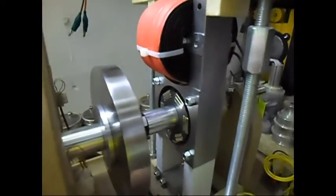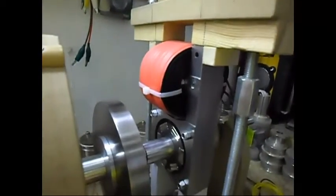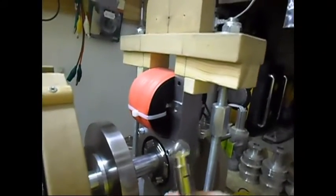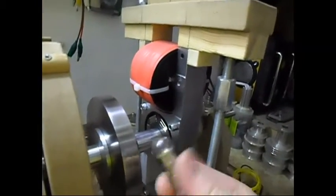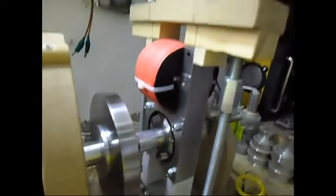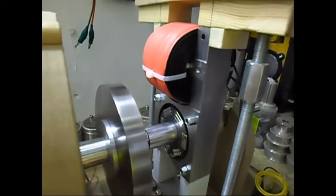In my case, I have in there two layers of 5mm magnets, which makes 10mm magnets. But with this configuration I get very little output — so little that it barely lit a 5 watt light bulb. Very little, maybe half, maybe 30%, not more. So in my case, a coil in this position, even with those strong magnets, the output was pretty poor.